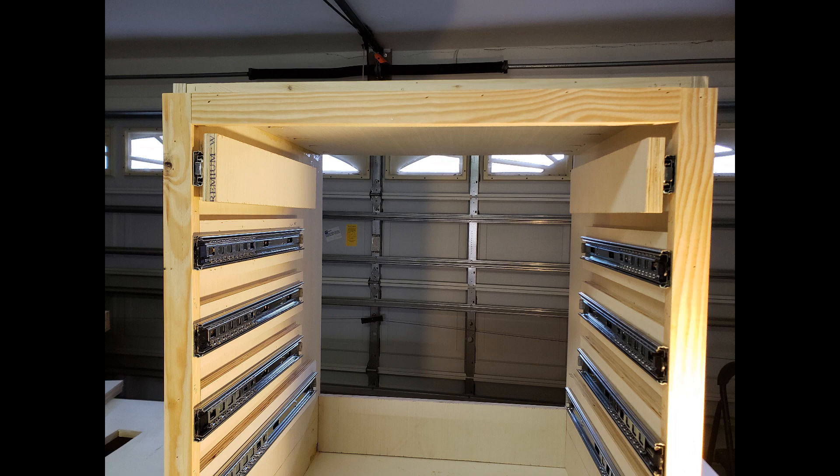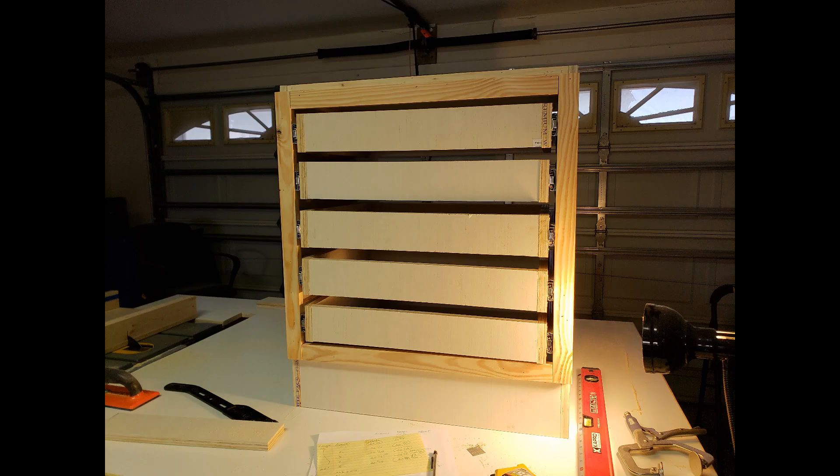Each drawer came out perfect. Now make the left and right sides of the drawer, measuring at least as long as the drawer member so there will be at least an inch between the drawers and so the drawer fronts will cover with about a quarter inch in between. Cut two of these for each drawer and attach the drawer member. Slide all these into the cabinet members already attached. Measure between the left and right sides and cut two for every drawer. Attach the sides on the ends with screws and add one quarter inch plywood bottoms. Add fronts to the drawers, centering horizontally to the facing and vertically so there's one quarter inch in between. Cut the correct size, start with the bottom drawer, and use the front skirt as a gauge. Attach the front with brad nails to hold in place, then attach screws from the inside sinking the screws. Space the next drawer with two paint stir sticks for equal distancing and continue for all drawers.